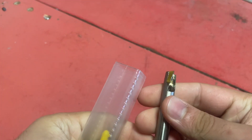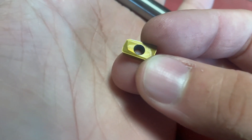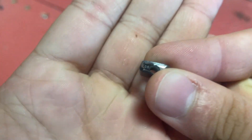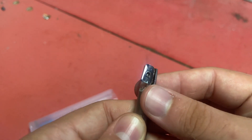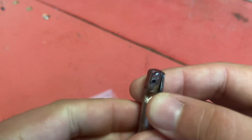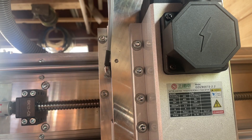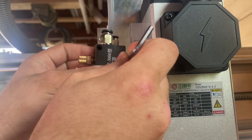One of the things I'm upgrading is the inserts I use on my end mill — from inserts used mainly for cutting steel to ones made to cut aluminum. They are way sharper and improve the surface finish. They improve how much it chatters, or rather how little it chatters, and they are just better suited especially for machines that are less rigid, such as mine.